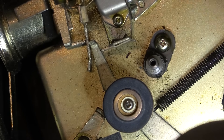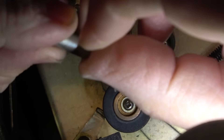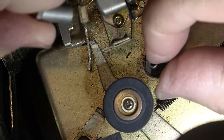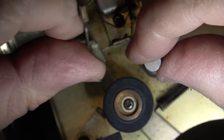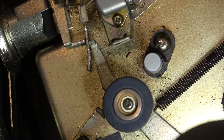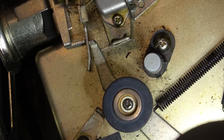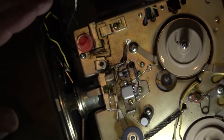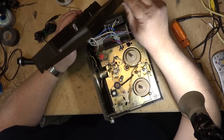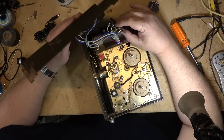The capstan shaft top unscrews and you remove it — now it's one and seven-eighths, so this is a two-speed recorder. It's got a capstan sleeve that fits over the top to give you the faster speed and just screws back on. So three and three-quarters and one and seven-eighths. This was a quite neat little machine back in the day, and as you heard when I made that recording, the sound quality is actually very good. I don't see any capacitor issues because if there were, it wouldn't have the sound quality it did.